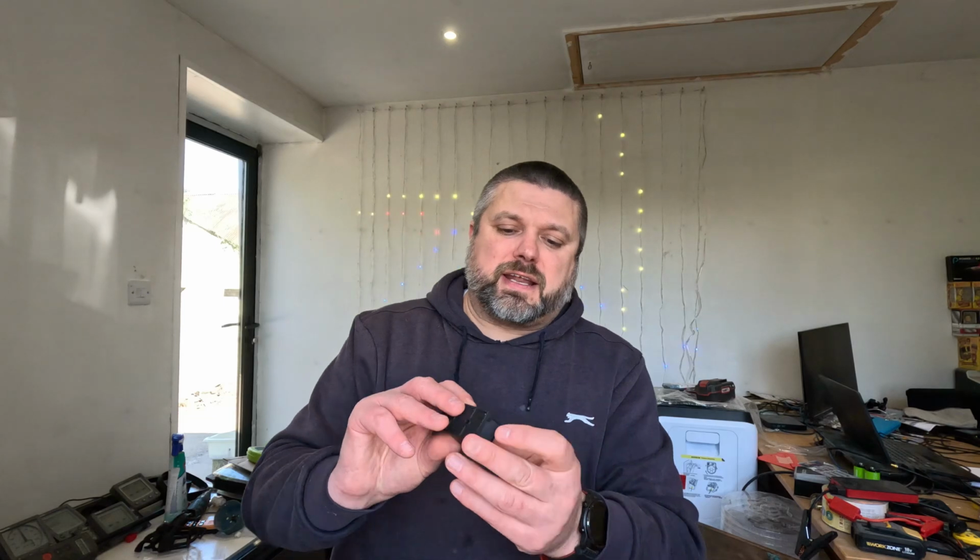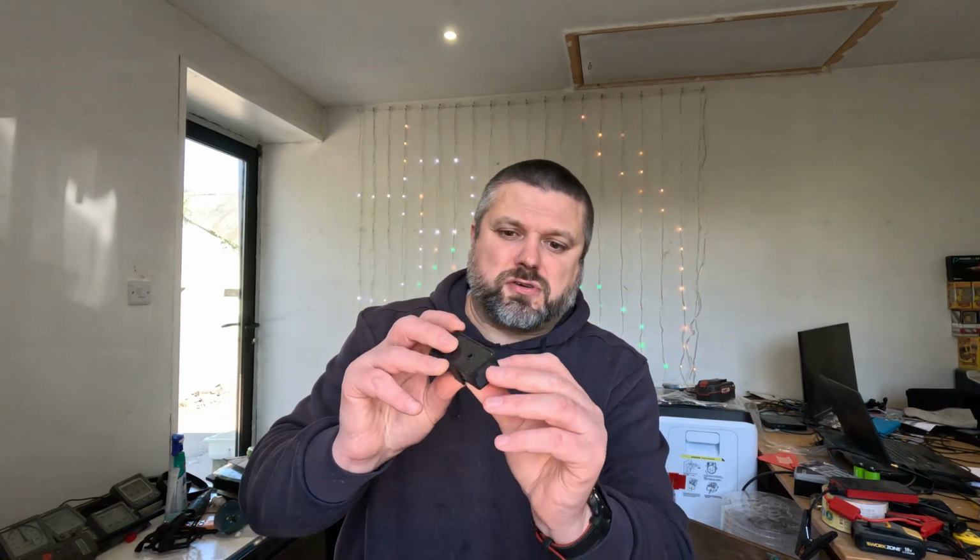I've also picked up another version, the version 11. It's slightly different in that it's RS485, so be very careful when you're buying. Do not buy the EW11A thinking it's better. It's actually different. It uses RS485. The reason I'm buying it is for a Modbus device I've picked up that I'm hoping to showcase in the future. Basically a wind instrument, very, very cheap, but it uses a different protocol, so I'm hoping to build some way of converting it to be usable in the boat.